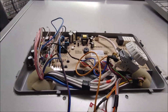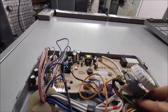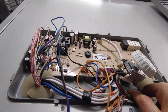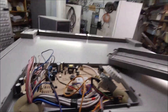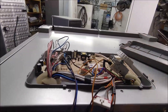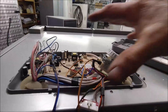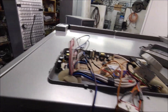This is the top of the fridge where the PC board is. This is the thermostat I've put in - I made a little hole there where the bulb goes through onto the cold plate. And this is the defrost timer. It's got a cover that goes over this. Once I'm happy with the thermostat adjustment and everything else, I'll mount everything inside this cover and close it up, so from the outside you won't notice any of these modifications.